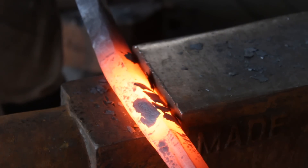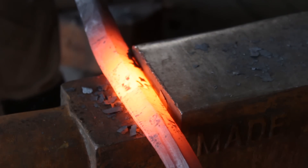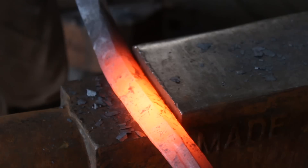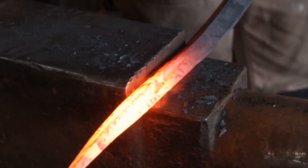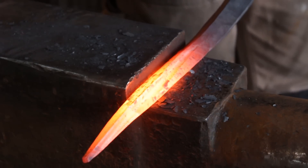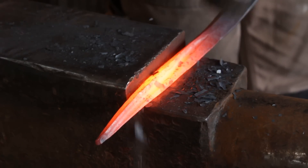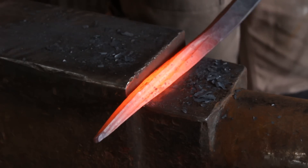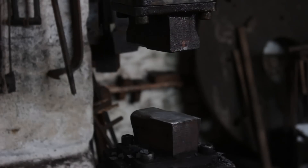I'm doing this probably to about 12 inches from the point of the blade, because I do need that round collar at the top. I'm going to leave an extended round section at the top of the blade and then grind the triangular section into that last bit, which will ensure I have the rounded collar at the top. I'm forging down along the fullered section as well to get an even shape to the triangular section. At this stage it doesn't matter if I move the fullers around because I will go back and put them back in.